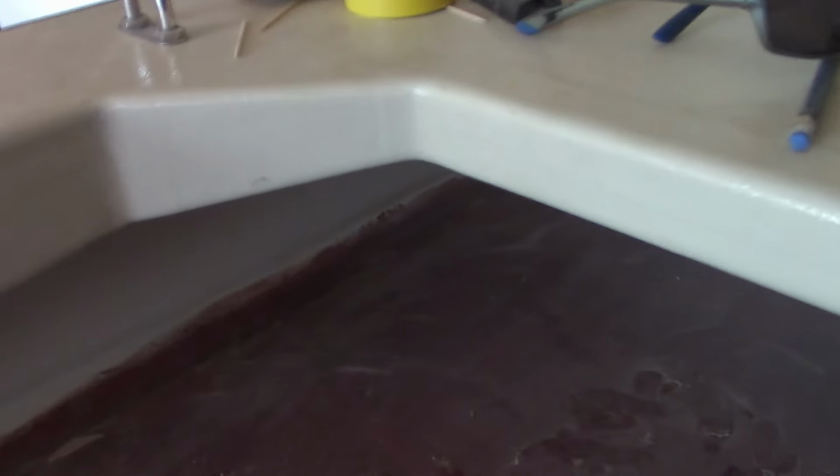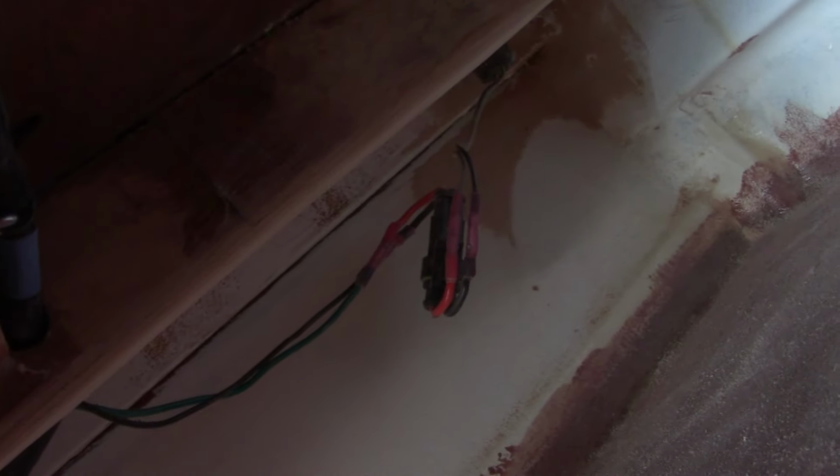Let me show you what I'm talking about here. Let me just knock my flashlight over. I installed that brace for a poling platform that I hope to put on this boat one day. The brace is there so I'll have a good solid attachment point, and also to support the weight of the platform when I'm actually on top of it. But anyway, that's the brace I'm talking about right there. I had to remove probably right at 1/4 inch of material from the bottom of that brace where I'm running my finger. That's about an 18 inch section that I had to carve a little bit of material out of, so that the tank would clear and go up underneath there. And again, I had to do that to both sides.